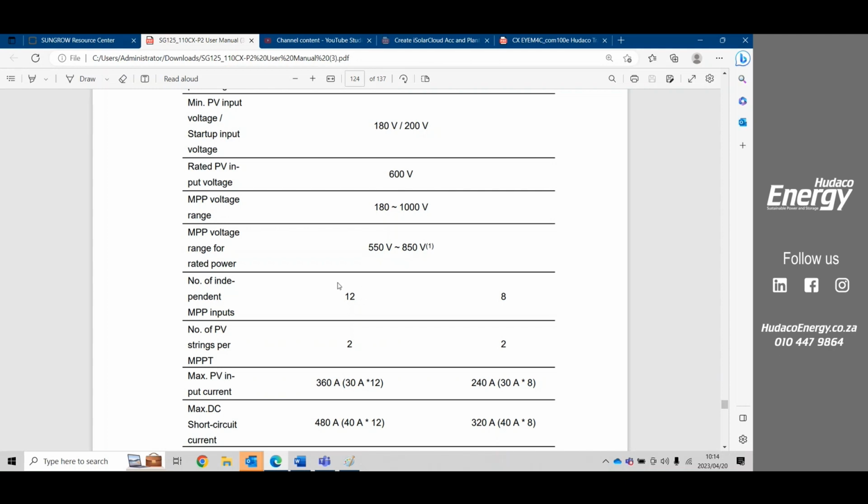If you do have too much of a variation in one MPPT, you're going to be picking up some faults. The inverter has a protection inside it. It's either the AFCI, which is arc fault detection, or it's going to give you a reverse polarity. So the manufacturer takes it for granted that everybody understands this philosophy, that you're going to have same orientation and same elevation modules in one MPPT, and so they provide enough MPPTs to accommodate multiple roof alignments.